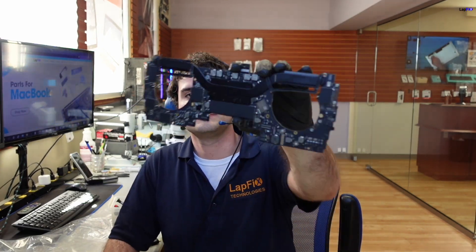So let's go ahead, remove the board, and go under the microscope to take a look. Close to where one side of the ports are — that's not the major concern, we can just brush that off. Just doing a quick scan to see if there's anything else outside the obvious damage. The power button area looks fine — looks like the shield did its job, which is good, that's why the shields are there. And here is your major problem: this is a BGA chip, this is the U7800, and we're going to do a repair for it.